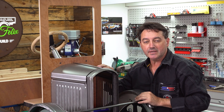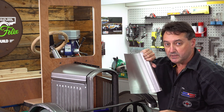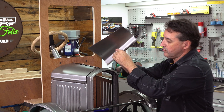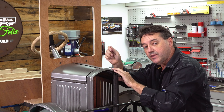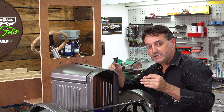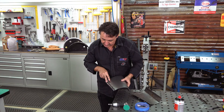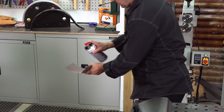The second method we're going to demonstrate is MIG plug welding. To do that we're going to have to clean some paint off first. Both sides of the hinge have to be clean, and also the back underside of the bonnet must be cleaned. We'll then apply weld through primer to this face and the face of the hinge. We can then reset our bonnet and mark when we're in position with the scriber, so we get the inside face of the hinge all the way front to back, and also scribe the hole locations. I've sanded both sides of the hinge - I'll mask this face up and apply weld through primer, and also apply weld through primer to the inside face of the bonnet.